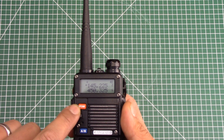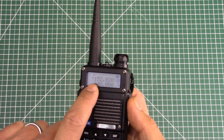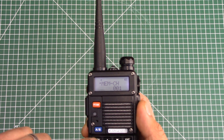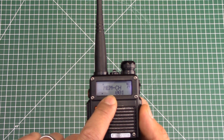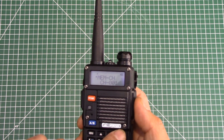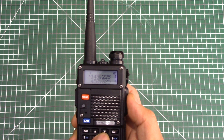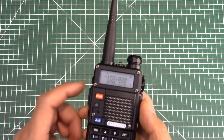So just for practice, let's do that again. Let's hit VFO/MR to get into frequency mode — it's already showing 152.020, which is what I want to store. So I'm going to hit menu, go to option 27, push menu again to start picking channels. It's on channel number one and notice there's no CH prefix, so I should be good. I'll hit menu — 'receiving memory' — and there you go, I've stored it. If I come over here to channel mode and go down to channel one, there's the 152.020 that we wanted.